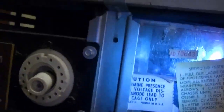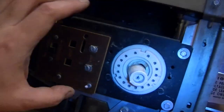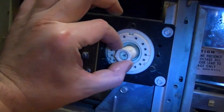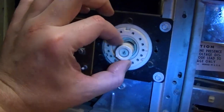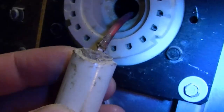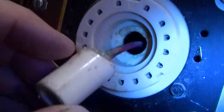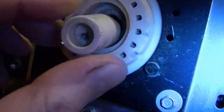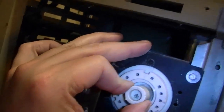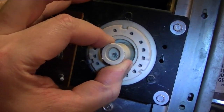But like I said, everything I can see, including the high voltage cage and the original labels and everything. So I'm going to be real careful with this set. Pity this is damaged. Now, I suppose there is a vague possibility that somebody somewhere out there has a junker chassis and I could get a replacement socket. I doubt these are still available commercially. I'm sure that Philco made up a custom socket for this. Sure, I could probably glue it back. In fact, I bet somebody already did try to glue this back in place. So it looks like there's some kind of adhesive residue, and it doesn't fit in that firmly, so I think there's a bunch of goo or glue residue on there. But I suppose a little bit of careful adjustments and some good quality epoxy glue would get that secured fairly well.